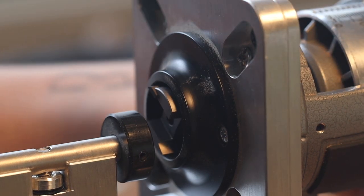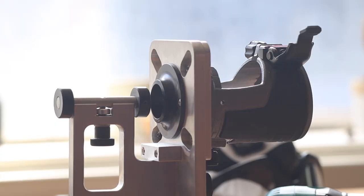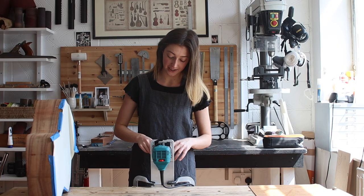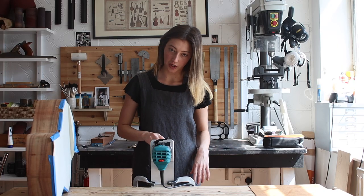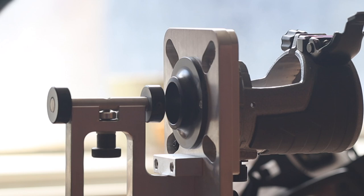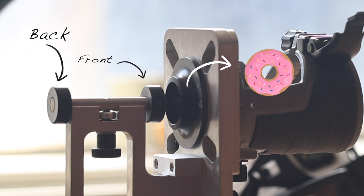There are three points of contact on this jig: two riding bearings, and you ride the sides of the guitar off those. If you have the guitar riding against the back bearing at all times, you're not going to be able to physically overcut your channels, which gives you a nice peace of mind. It's got the back bearing, the one nearer the front so you can square it off, and then the donut that is traditionally used for binding to give you something to ride against the router bit with.